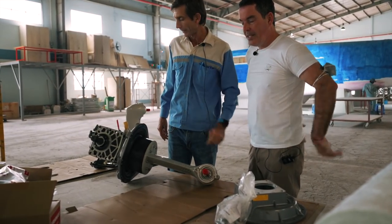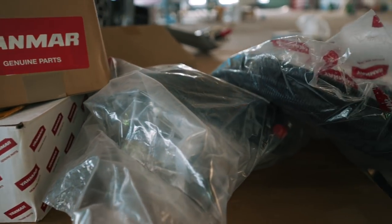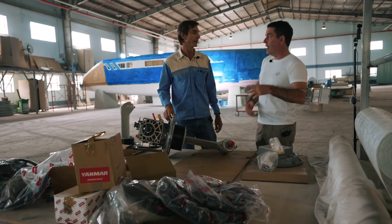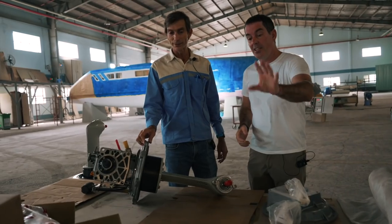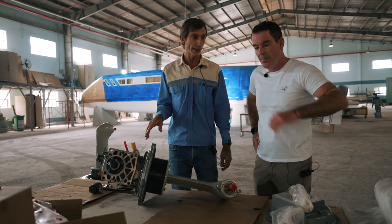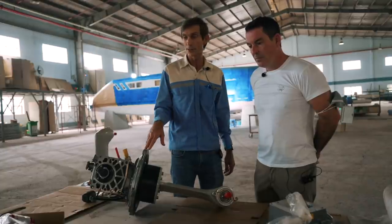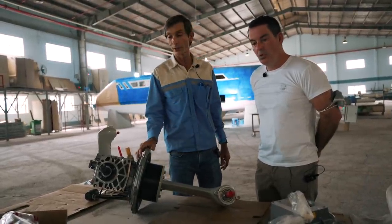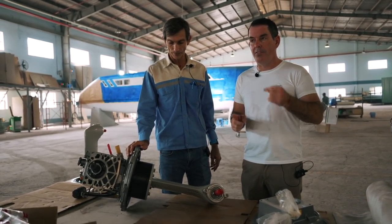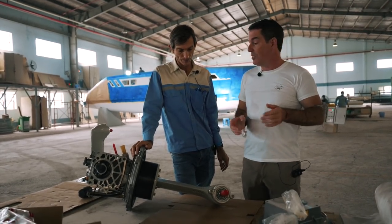All these other parts are wiring looms — it's an electric drive system. You can see the difference compared to a mechanical system. This is part of the wiring loom that goes to the VC20s. Some of it goes in the engine room because there's an electric actuator controlling the gear change and an ECU separate from the engine. Some of the wiring harness goes up to the controls at the helm. Thanks to James for running us through all of this — really informative for anyone with a Yanmar SD60 sail drive.